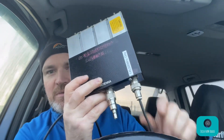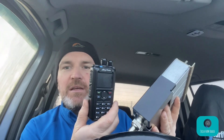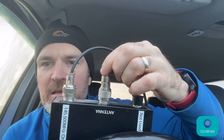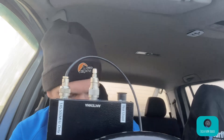I've done that now with this duplexer, as you can see — I've just labelled it. I have a cable coming off this to a female SMA, which is going to be plugged into my Anytone AT-D878UV, which I usually use for my 2-meter portable operations. On the other side I just have an adapter on the antenna port with a male SMA, because I'm going to put my female SMA antenna onto that. I've blanked off the other side of this duplexer, which would normally be used for a duplex frequency system.